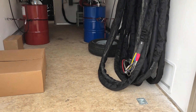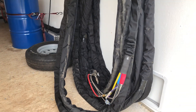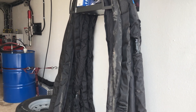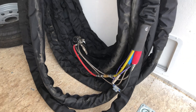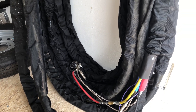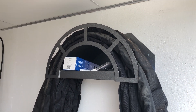If you come in from the back of the trailer, you'll see on the right side we have 150 feet of high-pressure 3,350 PSI hose that we manufacture here. We use the Velcro-style scuff jacket on it, purple three-pin thermocouple wire. We've paired this with a Graco fusion gun, and a steel professionally manufactured powder-coated hose rack.